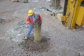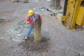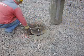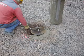Sometimes there are surface layers where displacement of material is slow or impossible. In such instances, the probe is vibrated without a sacrificial tip first and the material is plugged in the casing and vibrated out on the surface. Then the sacrificial tip is positioned and the process continues as usual.